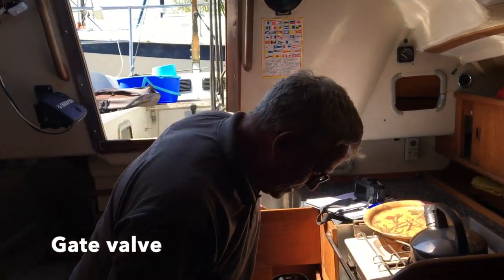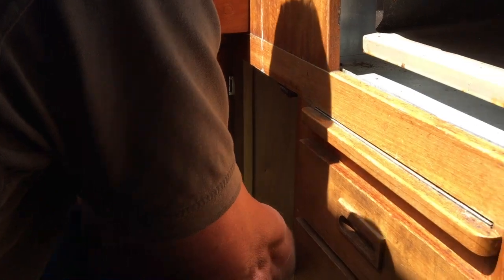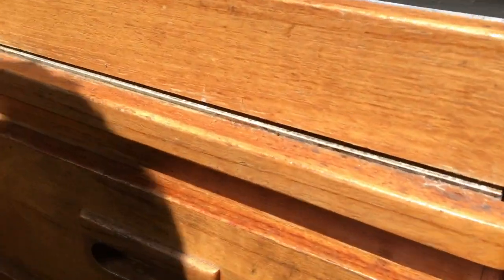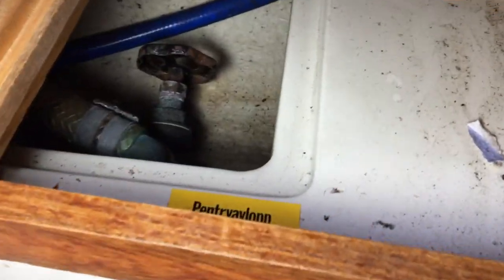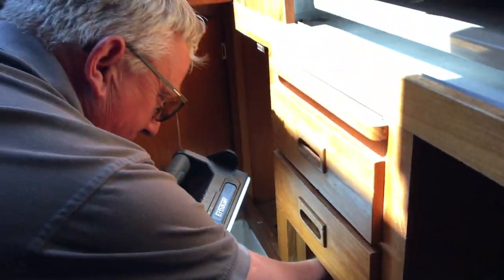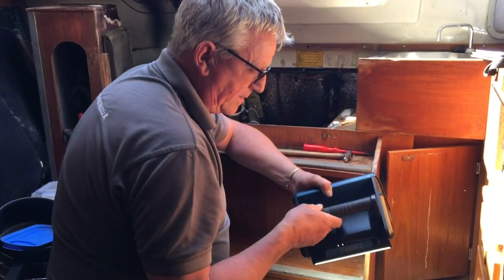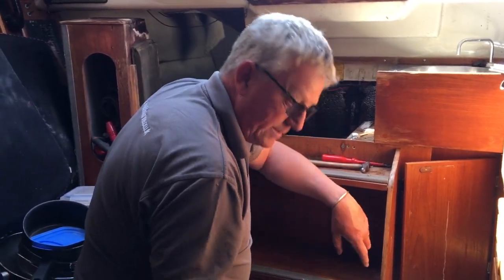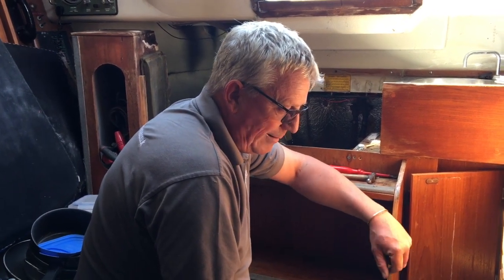We have a sink unit here. From the outside of the boat I know there's a discharge in this area, so I was looking down here and there's a removable plywood panel. I opened this one up and couldn't find the sea cock in there. I've taken all the screws out, and you can see that the discharge hose is actually running across to here - so it's not in what I call the obvious place. Bottom drawer out, and there's our sea cock, which is actually an old fashioned sluice valve - completely and utterly seized. That's something that will have to be changed or freed off. For the sake of a few quid, I'd start with a new valve in there completely.